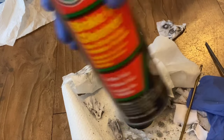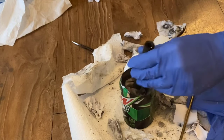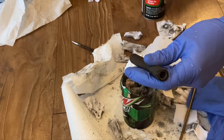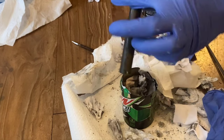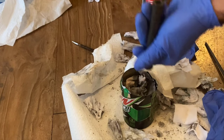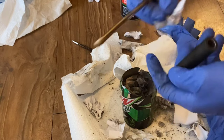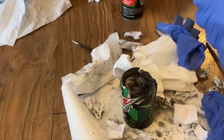You're going to need to take out the barrel each time for cleaning after every single cut, for each of the four processes. I'd strongly recommend creating some sort of a waste collection container, specifically for the brake cleaner runoff, because it is very dirty and you don't want to spill it on your floor. I also found adding a brass brush to the cleaning process significantly decreased my cleaning times and also increased the finish of the barrel. I found I could still use paper towel or cloth to get the same finish, but the brass brush is just quicker, and I'd strongly recommend it.